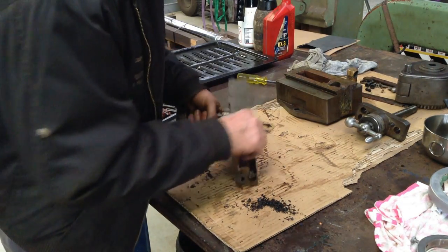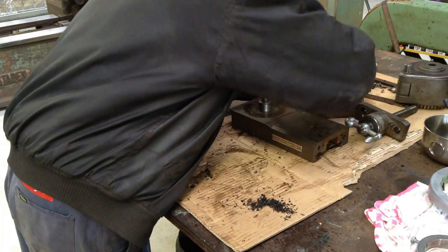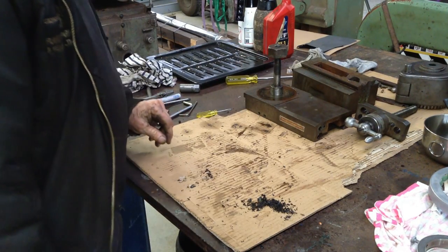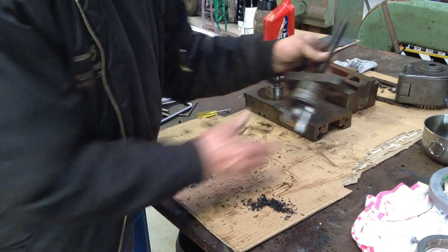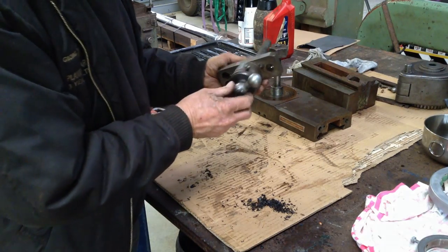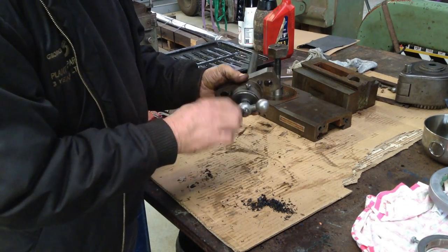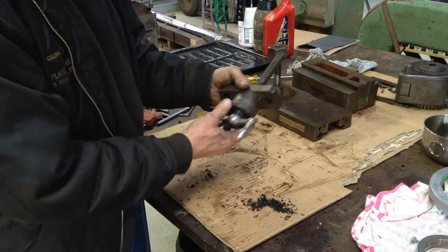Right, so there's machining to be done on this. So these parts are all ready for a really good cleanup. So we'll head back over to the cross slide. When I separated these and unscrewed this, I actually forgot to press record on the camera. This I'll disassemble over on the milling machine at the other shop, as I'll have a vise to put some soft jaws in to clamp the screw, and then I can tackle these nuts that hold the assembly together.